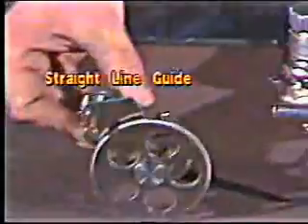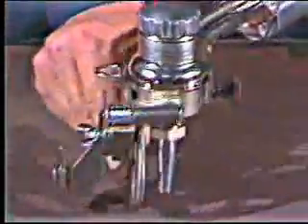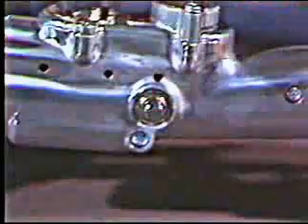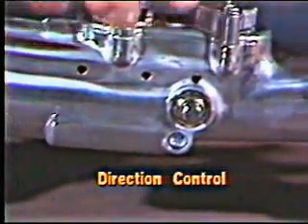The first attachment is a straight-line guide for 90-degree and up to 22-degree bevel cutting. The driving attachment can be rotated to any position around the head to help you reach difficult or far sections of a plate. The machine has a forward-reverse switch, allowing you to compensate when the drive wheel is moved from side to side.